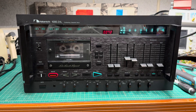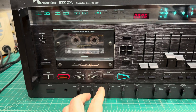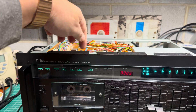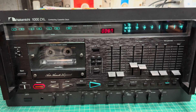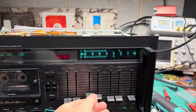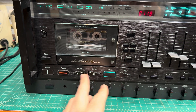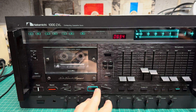All right everyone, I have good news and bad news. Good news: power supply works and I was able to start the deck. The only issue is the belt for the play mode is stretched, so it cannot fully pull. I have to pull out this board and manually help the gear get into position. Source current generator is working — I can adjust levels. Fast forward works, rewind works. Playback needs help — I need to pull out this board and help the gear into place.